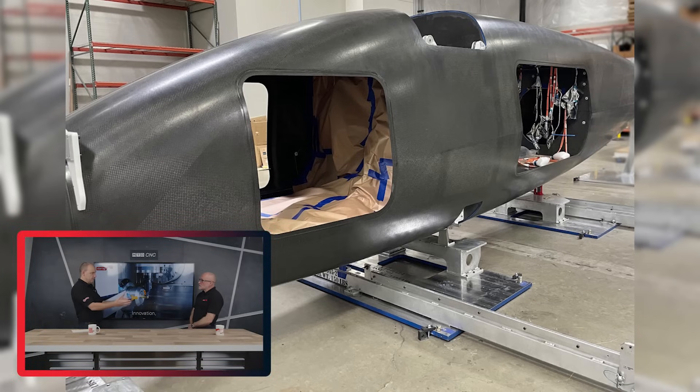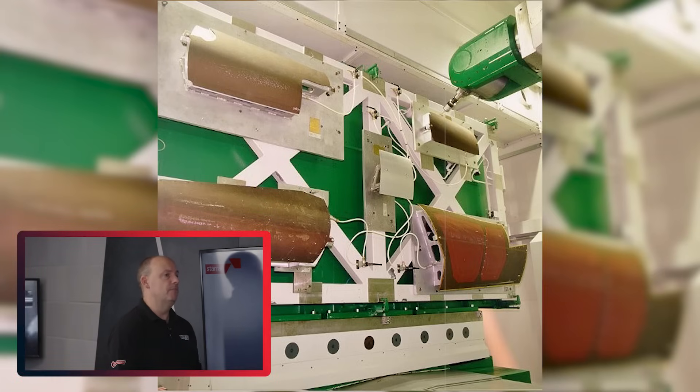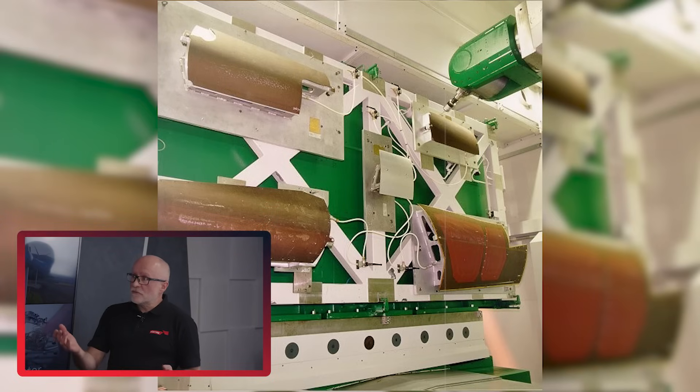It could be quite large as well. And what would be a problem with machining that type of material — what would machinists experience as issues that machines need to be built to overcome? Well, health and safety is a big thing because composite doesn't chip like a metallic would. So you've obviously got dust, so you either cut wet, or if you cut dry you have to have a very good effective extraction system on the machine.